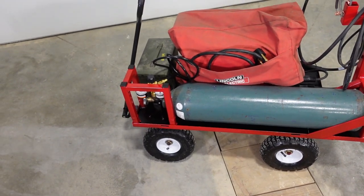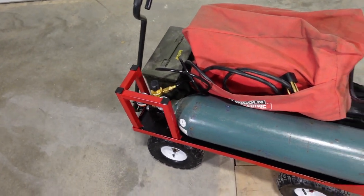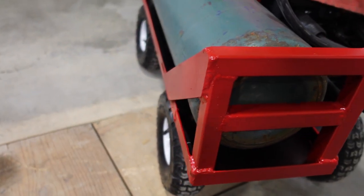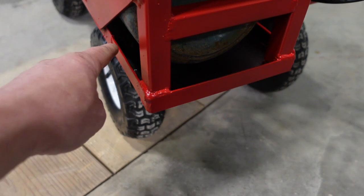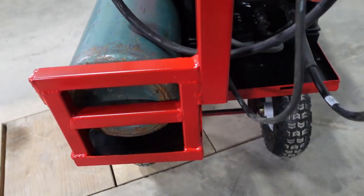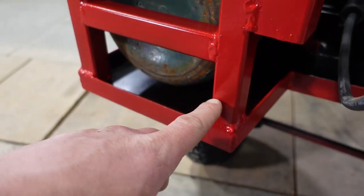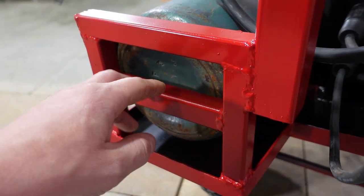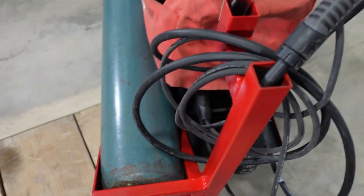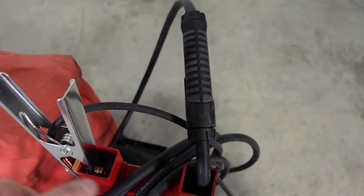If you wanted to mount your tank vertically you definitely could. The biggest thing that comes from laying it down horizontally is you have to protect the valve and you have to secure the tank. I had to extend the frame using angle iron — I'll put the specs in the description for all the materials I used. I simply cut open the top part of the angle frame, got some one-inch angle iron, ran that up and did some corner welds. I used one-inch square tubing to make sure the tank could butt up against it so it can't move that way. I also added some inch-and-a-half tubing for the hook to hold the ground cable and the gun — you can just set it in through the top and clamp it.